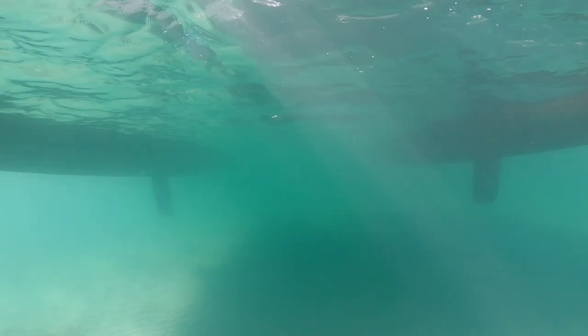As the wind increases we can lower both boards down, doubling our lateral resistance. As the wind gets stronger and stronger we're going to retract the boards a little bit, taking the pressure off their cases, so we might be sailing around with half of both boards down.